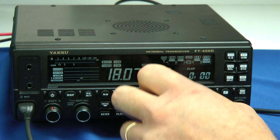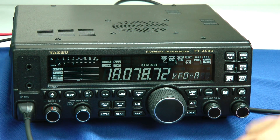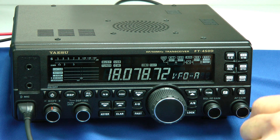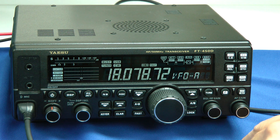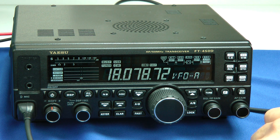We also have the clarifier button for adjusting the clarifier up or down — that's the amount of offset shown in this little window here. The tune button activates your automatic antenna tuner, which adjusts for SWRs of 3 to 1 or less, or a 16.5 to 150 ohm load. You really can't match some crazy short whip or a very high impedance antenna, but it's great for an antenna designed for the band where the SWR is creeping up at the band edge. Hit the tune button and it'll remember that setting.